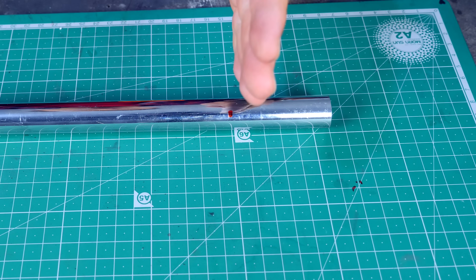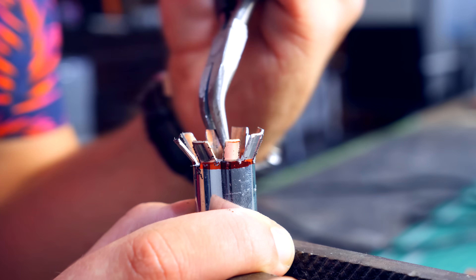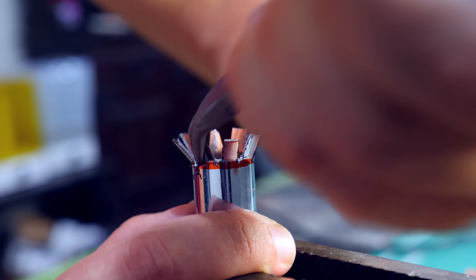Next, the flame tube. The flame tube is just a tube to hold the flame, so I got a tube and cut it with a saw. To create some turbulence that allows the air to slow down and thus make combustion possible, I cut the tube vertically so I could bend it and create some fins. That was actually pretty easy.